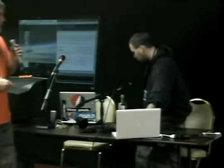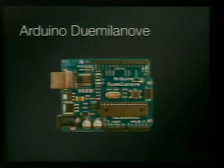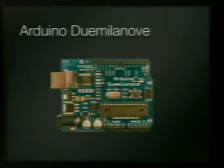Okay, this is the fancy one. I cannot pronounce that second word. It's Arduino 2009 if you don't speak Italian. And it's the latest, greatest version of the board. One of the founders just wrote a book, and they came out with this board at the same time, and you can go buy it. And it's like $30. And the magic between it and the previous version is this one will auto-sense if you have a 9-volt battery plugged up to it, or if you're trying to power it via USB.